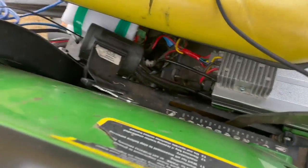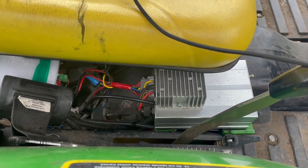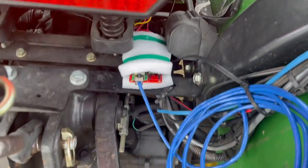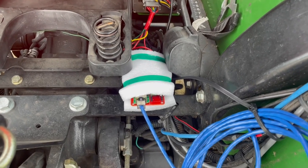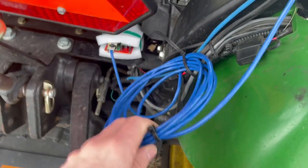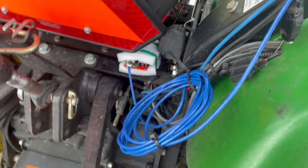If we look down here below the seat, there's my old V2 and now it's the steer board — it still picks up the on/off switch for the auto steer. Underneath the seat it's not super lovely, but that's the nav board. I just have my prototype board wrapped in some non-conductive foam because I wanted to test it right away. I've got this cord extra long because I want to move the nav up onto the frame later and didn't want to make a cable twice.